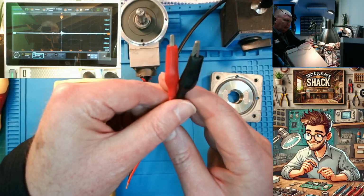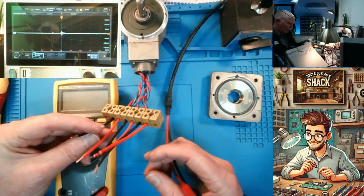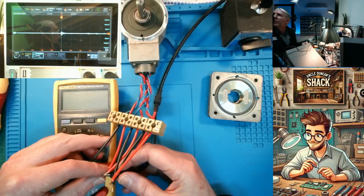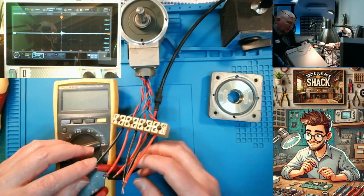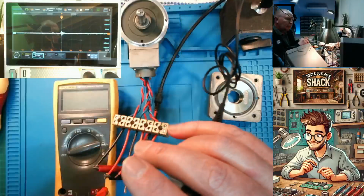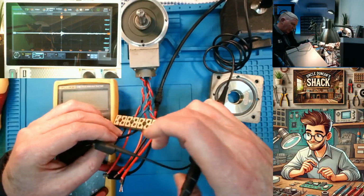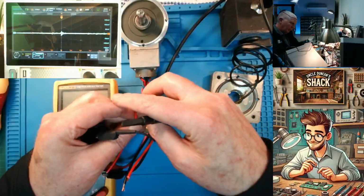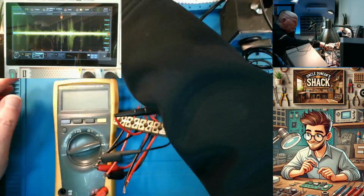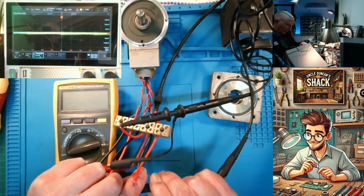So now we know that we're going to take our signal generator over here and hook it up to the primary like that. Okay, you can see what I'm doing, I'm trying to keep things in frame here. Then we're going to take our 2 scope probes, take channel A and connect it like so, and take channel B and connect it to the other one.